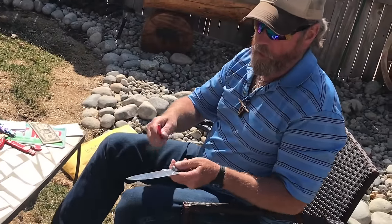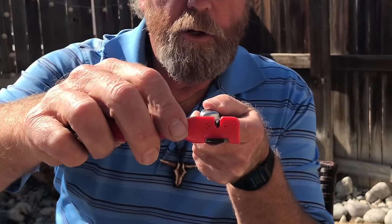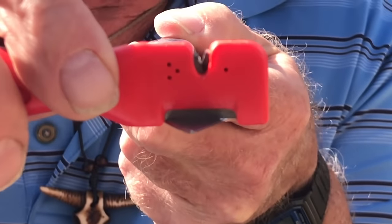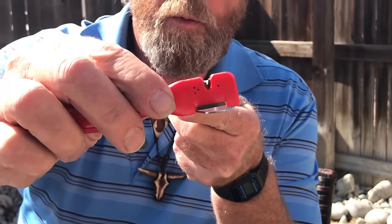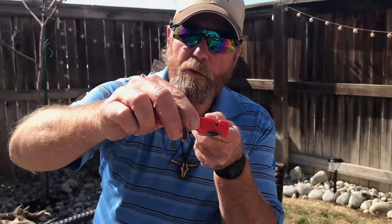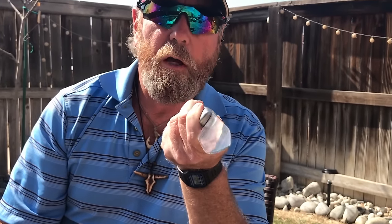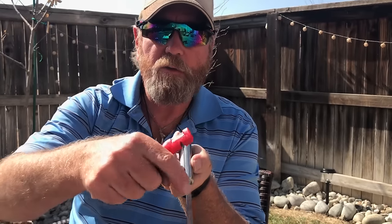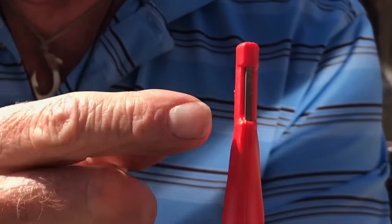The tungsten carbide straight-line open-face sharpener is parallel to the knife — that would not be parallel. So when I ask people to go about 10 degrees, I'm only asking for about that much. I actually get people at shows that claim they sharpen at 40 or 45 degrees. If I tip it over 45 degrees that's one side, and 45 to the other side — 45 and 45 is actually 90 degrees.